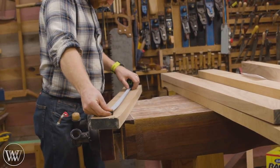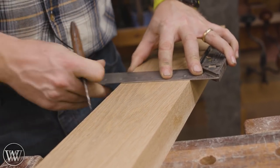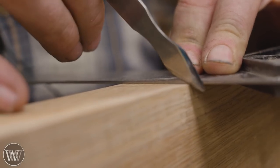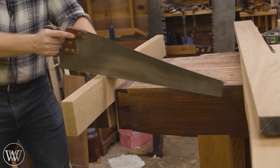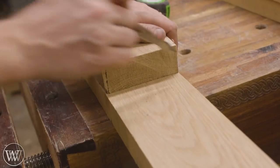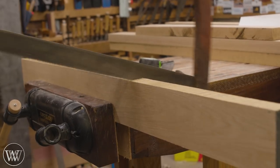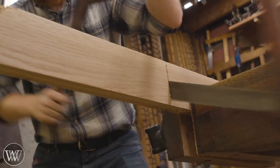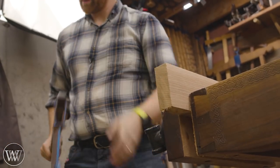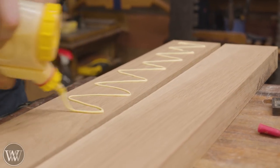Today we're going to be working on the legs and these are going to be laminated together. Each of these boards are about four inches wide by about an inch and a half thick, and when we laminate them together that will give us legs that are about three inches by about four inches. But before we do any of that we need to cut them all down. We had these all dimensioned in the last video, but the legs are going to need one step more - we get to use the buck saw, one of my favorites for cutting off things at a rough amount, especially for thick amounts like this. It's just a fast and easy saw to work with.